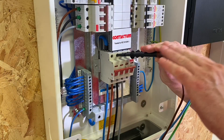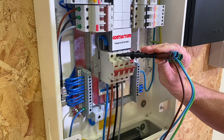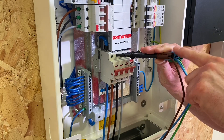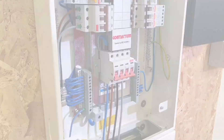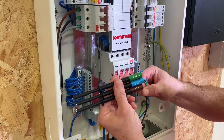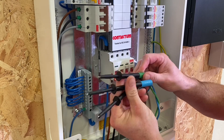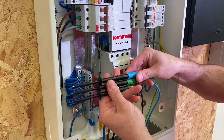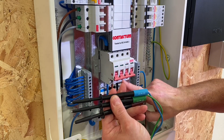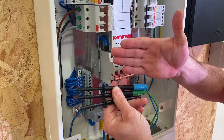What we'll do next is swap these leads around — but not the actual cables — and see what happens to the phase rotation if we didn't get L1, L2, and L3 probed on correctly. I'm going to repeat the process making a mistake with how I probe on my leads. I'll move these two round so I now have L1, L3, and L2 — still probing onto the right conductors, but in the wrong sequence from the test lead point of view.